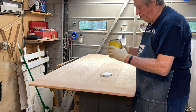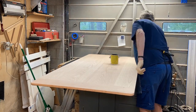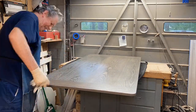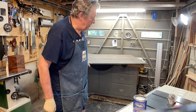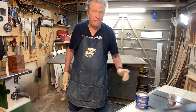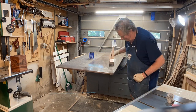I'm going to use a rag to apply the stain rather than a brush, because I want to scrub the stain down into the grain really deep. Now I'm ready to put a top coat on this tabletop. I'm using a water-based top coat — General Finishes High Performance Satin. This is one of the best water-based top coats you can buy. I'm using a Wooster Pro paintbrush, which is top of the line and made in my hometown. I'm going to put a total of three coats on top of this stain.